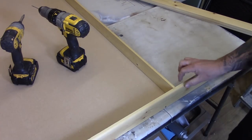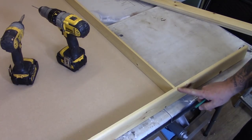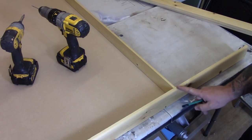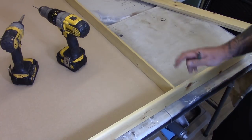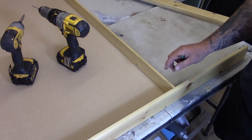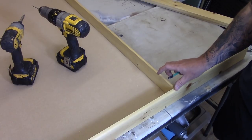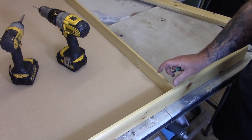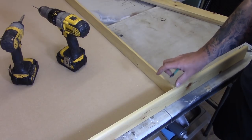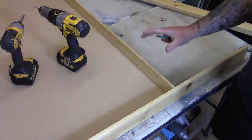As you go, you'll have an overhang — mark that off and use a hand saw, open saw, or jigsaw to cut it off, then wrap-sand the edge round for a nice finish. You can mitre these corners, but honestly a butt joint screwed together is going to be stronger than a mitre joint. A mitre joint will look neater, but a screwed butt joint is very solid. At the end, go around all the joints with wood glue to solidify everything.